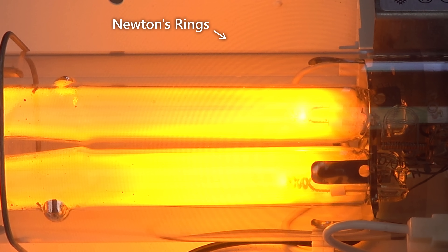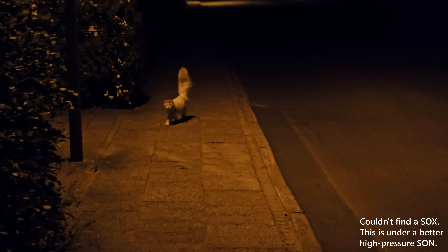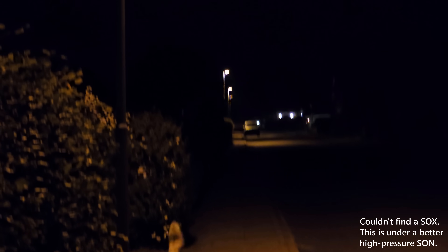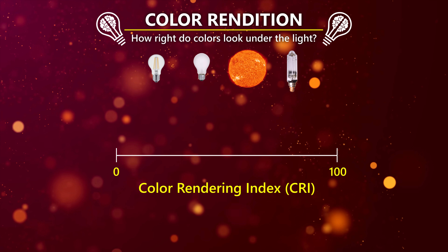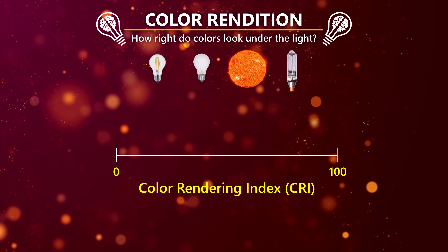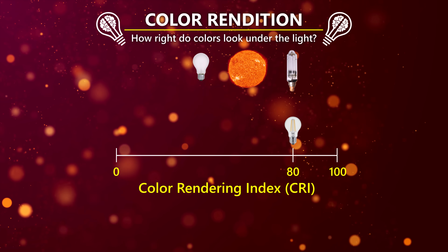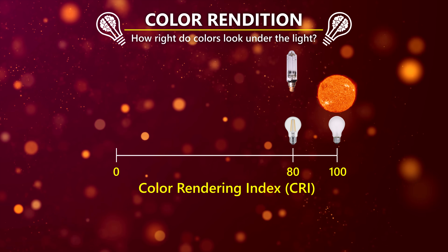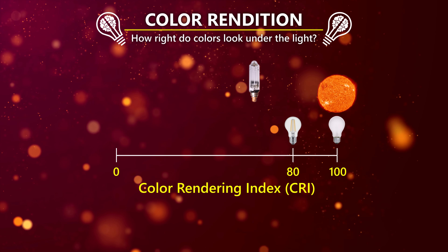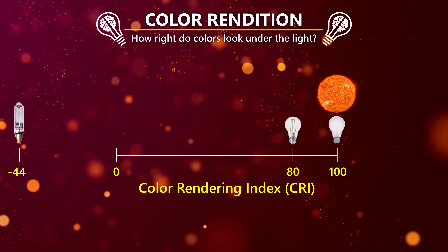This weird spectrum makes for a weird experience when using this lamp as the only light source — for example, Newton rings forming in my camera's lens. And another effect you may have already experienced back when these were widely used as streetlights: this technology's weak point — poor color rendition. It is horrible. I often complain about how the acceptable CRI for LEDs has been set to a low 80, bad compared to the perfect 99 to 100 from a simple incandescent light bulb or sunlight. However, this mini-SOX is quoted to have a CRI of negative 44. Ouch!